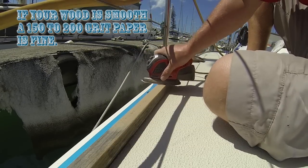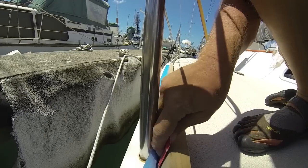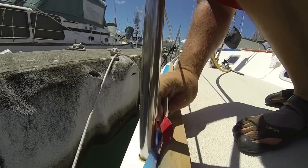This little mouse works great. I'm using 80 grit sandpaper because I do have quite a bit of ridges. Once I've got the rails done with that as much as I can, I use a small piece of scrap sandpaper and get all the little places that the sander couldn't reach.